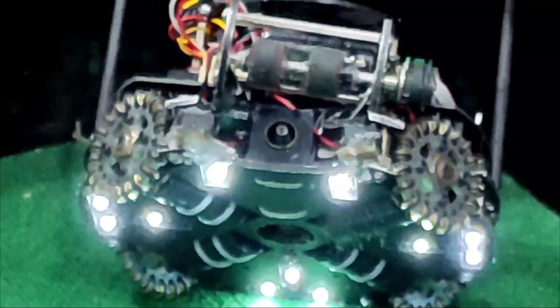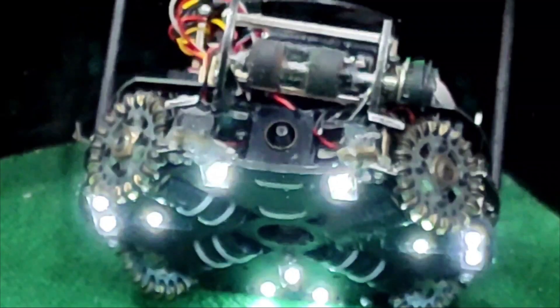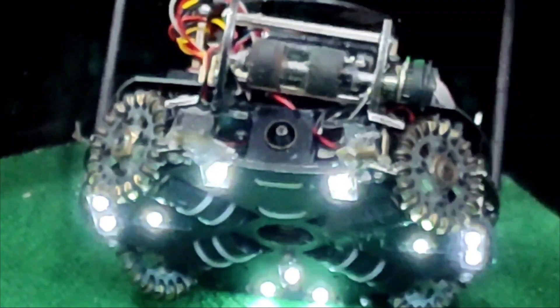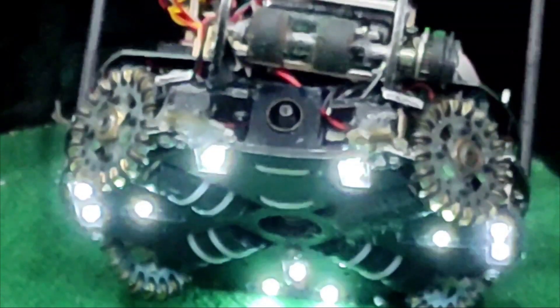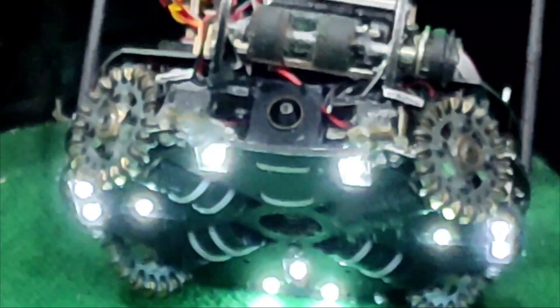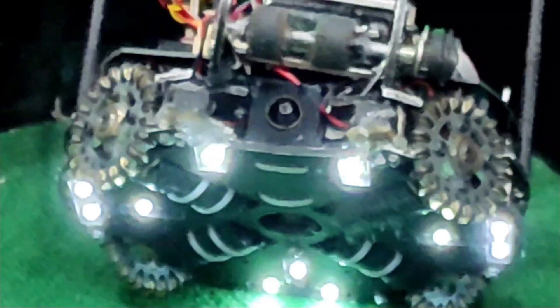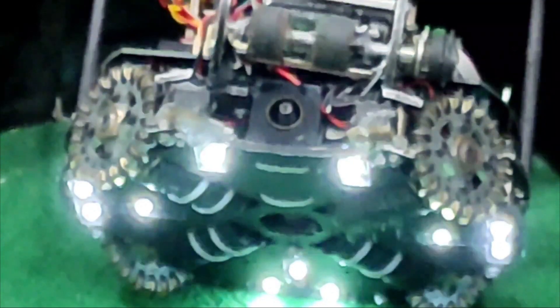The robot shooter system consists of two electromagnetic and electronic parts. The electromagnetic part is a coil that has a core inside, and this part is located in the mouth of the robot. The electronic part is a board that boosts the voltage and controls the system, and this section is located in the middle of the robot, below the motherboard.